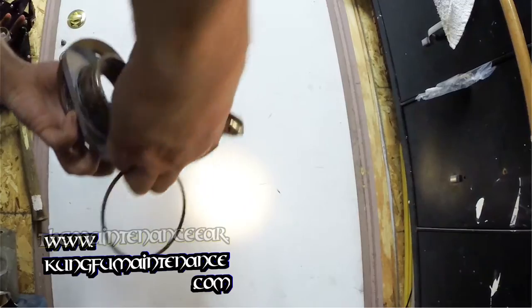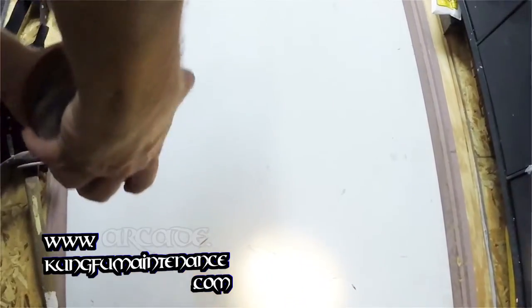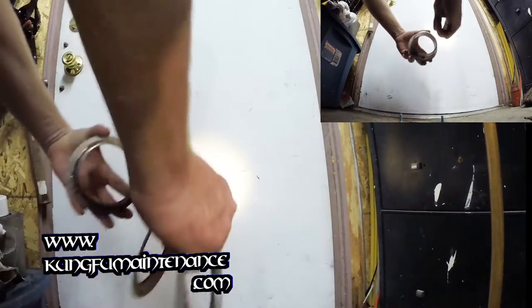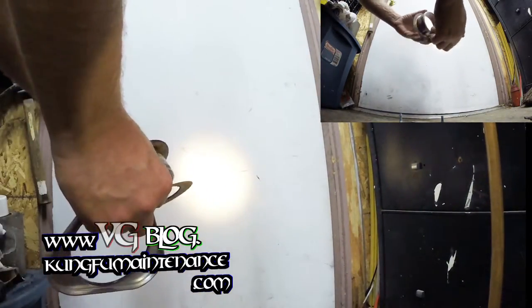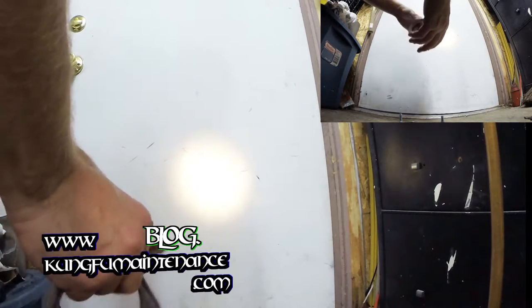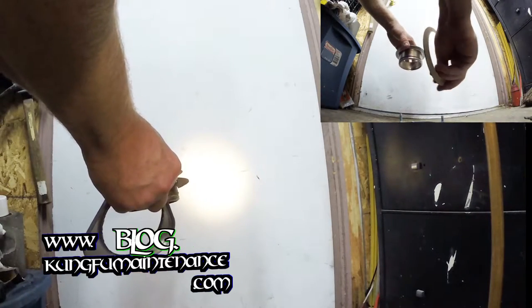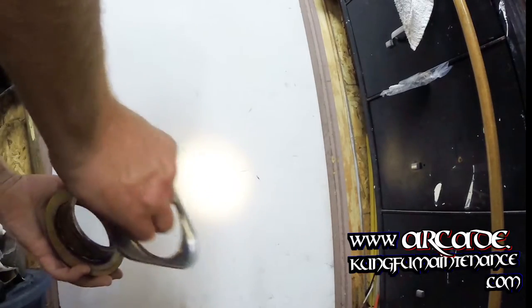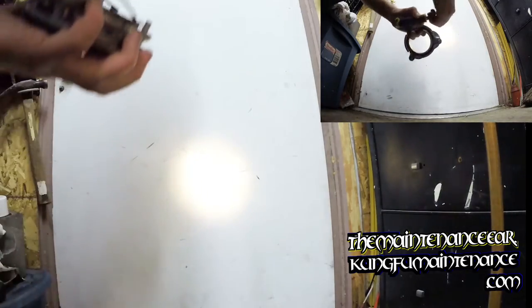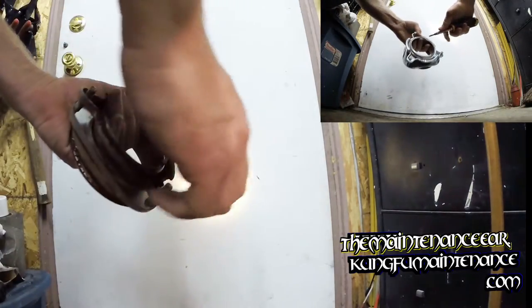What you got is your plate. And you put plumber's putty around the inside of the drain, or you can put it around the inside of the cup here. Slip this on so the cardboard goes down in the drain. Underneath, this goes up against the bottom of the sink. And then is your plate, and then is your turning deal. Now these, you loosen up the screws. And then there's the snap ring. And here's the snap ring.